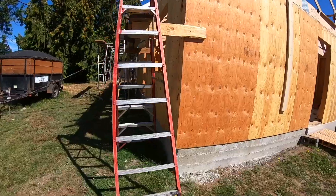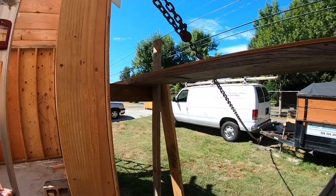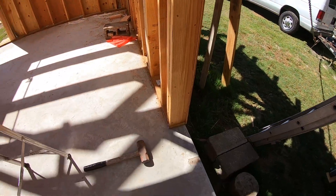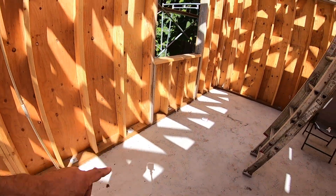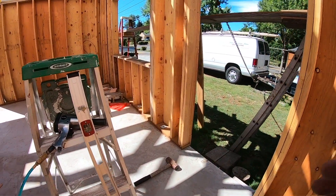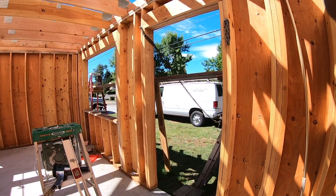Let's go take a look around. When I put a level on this wall, it moved a little. When I put a level on this doorway here, my bubble was slightly off. I noticed at the bottom of the wall we're moving a little bit. I forgot to go around and tighten all these anchor bolts and the bolts for the HTT4 shear wall bolts. So I move the bottom of the wall in, I'm going to crank that down and then come along that out, just to hold it perfectly level while we finish the framing on this project.